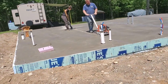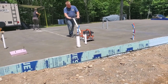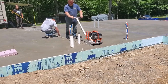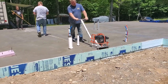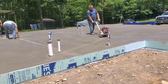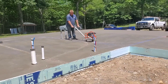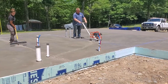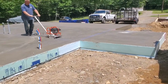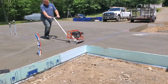It's 12:40. We started power troweling at 11 o'clock and got done pouring the concrete at 8:30. So about four hours later, we're sawing it — that's how fast this stuff dries in the summer. If you're thinking of doing this yourself, you've got to be really prepared and know what you're doing. We always saw our expansion joints in the same day — that's why we got that saw. It's a special saw for doing it green. You can saw them the next day, but I'd do it early morning if so. We saw them the same day. You can see we've already got all the forms stripped off. This has styrofoam all the way around and under it. From the time we got done pouring at 8:30 until we're troweled and sawing — it was only about four hours. That's how fast this stuff dries.